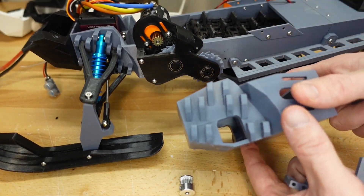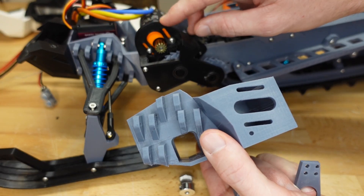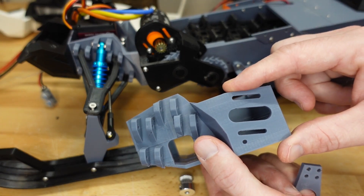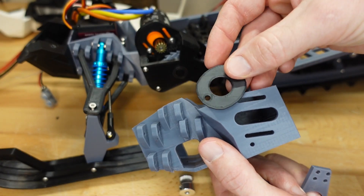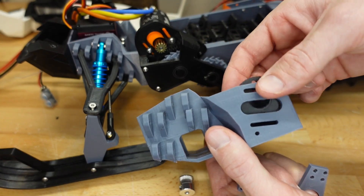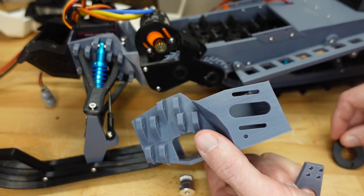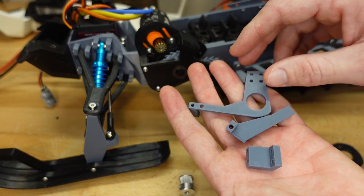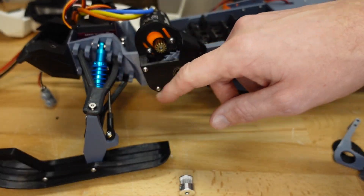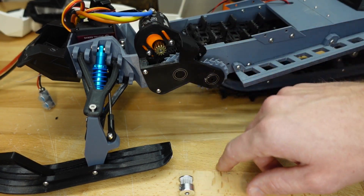Now aside from those pieces you're also going to need some 3D printed pieces. I have a new frame here — the motor mount for this frame is actually built right into it instead of being a separate piece. One issue with that is that while this is printed out of PLA, I want my motor mount generally printed out of something a little more heat resistant. So I've 3D printed this little motor shim out of PETG — it's a 2mm shim that should get my spacing about right. These right here are the 3D printed pieces for the tensioner. Our first task is to disassemble all this, remove the front frame and suspension pieces, get that front frame replaced, and then we'll be ready to actually install the belt drive.